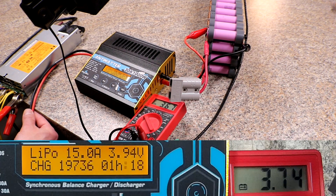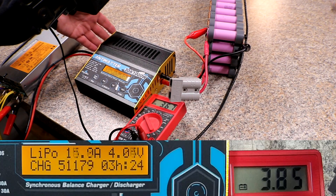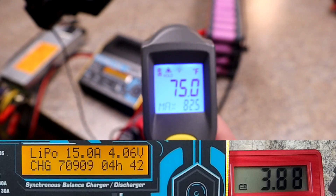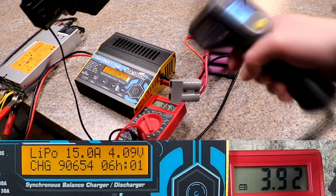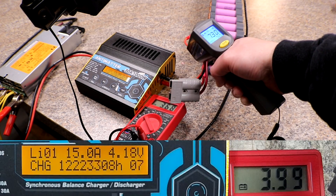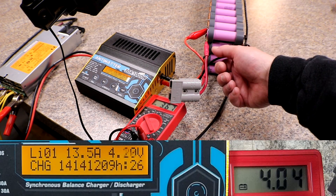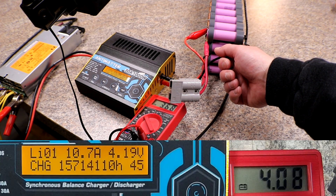The wires on this side are not even remotely warm — still actually cold to the touch. Oh, this is the intake side; the air is blowing out on the other side. It's about 82.5 degrees, and the little wire connectors are a little warmer. Highest reading over there is 93, the rest around 84. So basically these wires right here are just a little too small for 30 amps.